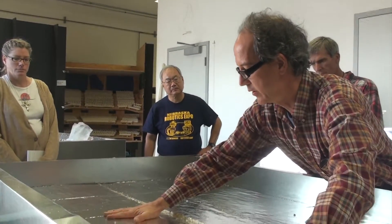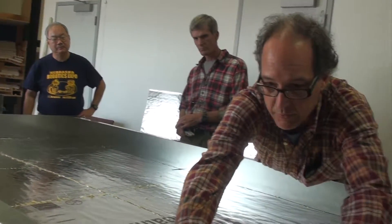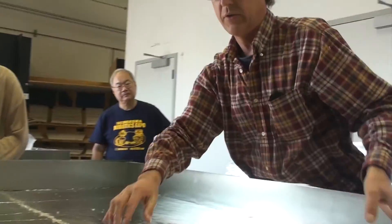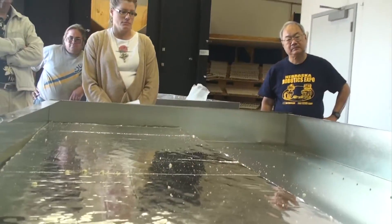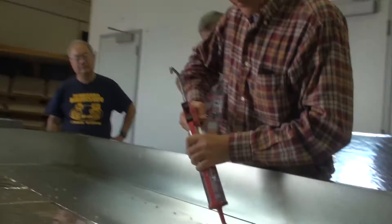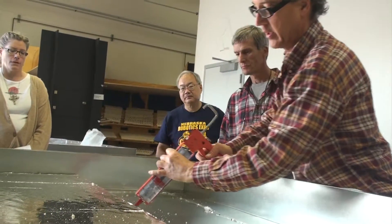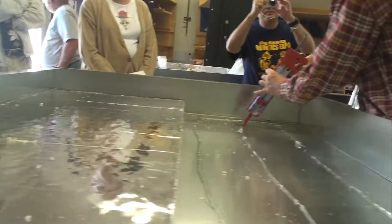What you want to use is pure 100% silicone. You don't want to use the acrylicized silicone — it doesn't work as well. Make sure you get it squished down a little bit so that it's firmly adhering. Silicone will set up in about six to eight hours; if you leave it overnight, that's better. So we'll do another round of silicone. It's available at Lowe's, Home Depot, and all the big box stores and even the family hardware stores — that are getting harder to find, so better patronize them before they go extinct.